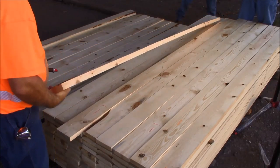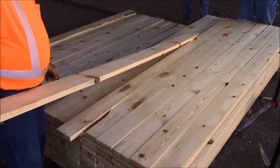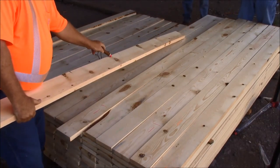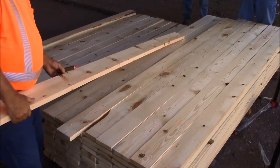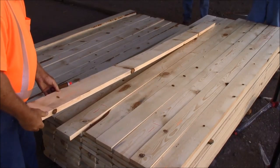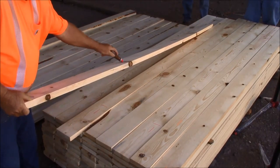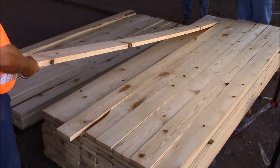That board has a hard center down one edge of it with numerous little knots. I don't have enough here to get by for a sash cutting — I don't have the 28 inches for a sash cutting, I don't have any finger joint. The only cutting I have on that board is possibly right here, but that's not enough for a third, so that piece will not grade 3 shop.